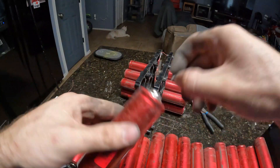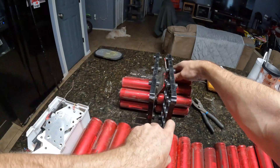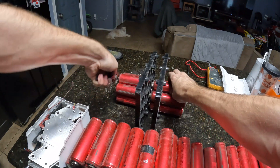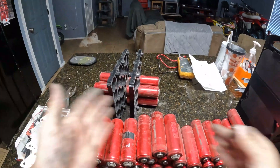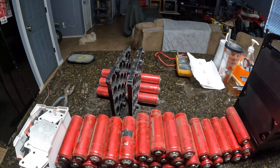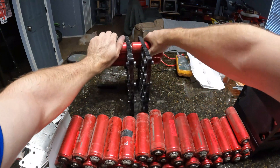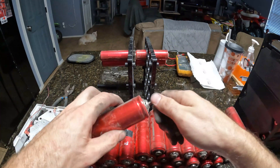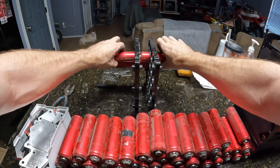This one's got a little bit of a tear in the plastic, but that's not a problem. Just be careful because I'm pretty sure the entire outside of each cell is either negatively or positively charged. It looks like a lot more cells once you get them out — should be 48 total. These are about $200 and some change per module, so it works out to about five bucks a cell, and that's the cheapest way to buy Headways as far as I know. They're used, but LFP chemistry normally lasts a long time, and Battery Hookup tests their used cells.